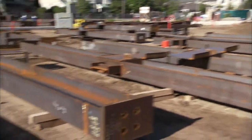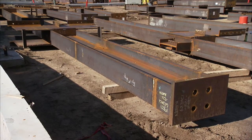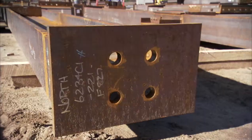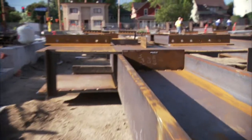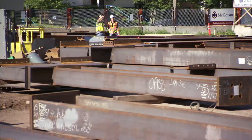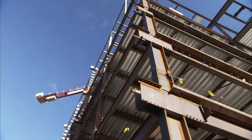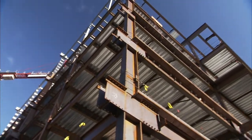The columns arrive at the site with the side plates and top supporting deck angles already attached to the column. In addition, a temporary construction aid has been welded on the bottom edge of the side plates at the shop in order to maintain the required clear distance at the top edge of the side plates, which allows the installation of the moment frame beam.